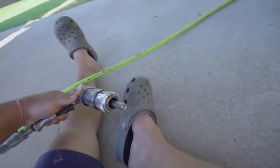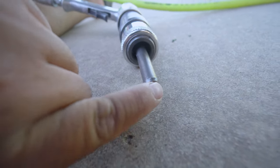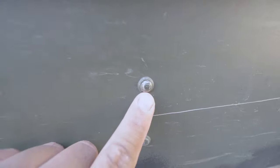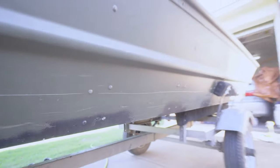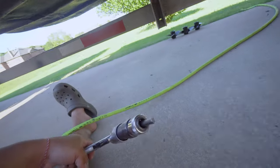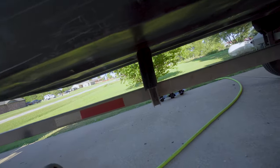As you can see, you need one that's got this cut piece so that it can hold on to the rivet. I know I bought the wrong size — don't give me flack for that. It's a little small and not the exact same shape, so if you do this properly you need the exact same shape. I got these pieces off eBay for like ten bucks. I attached it to the air hammer — this is a cheap generic one — and on the other end, I had a backing piece.